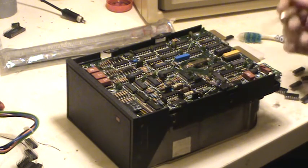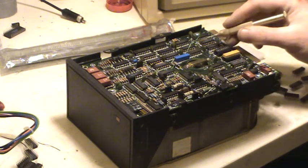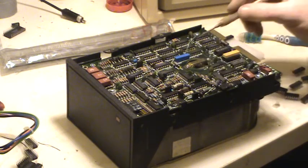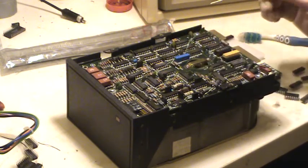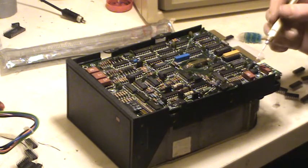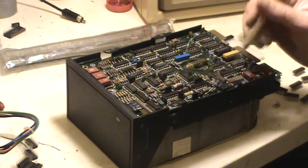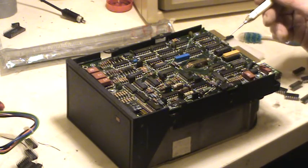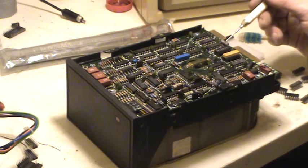Still had a 5 volt to ground short. I raised up all these little wires from the board that were all neatly wrapped around stuff, just to check all those. Couldn't find anything. I replaced the 2 tantalum capacitors. This is the one that exploded, and I was advised to get rid of this one too. I've been advised on another forum now to change this one as well.